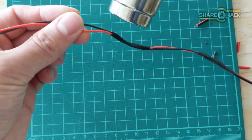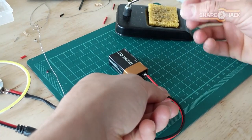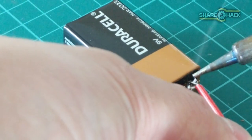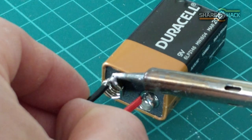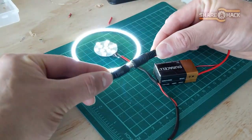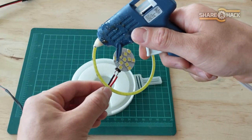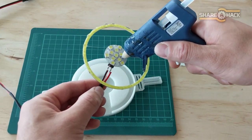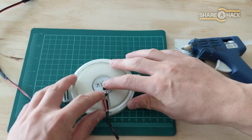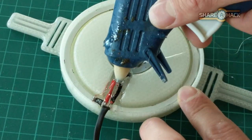To make the light a little bit more modular, I soldered the main wires to a male pigtail connector. I didn't have a proper 9 volt battery connector, so I soldered the female pigtail connector directly to the battery. If you do it this way, be careful not to heat up the top of the battery too much — the top part is made of plastic and too much heat will destroy the battery. Make sure your glue gun is nice and hot, then apply a minimal amount of hot glue all around the lights and press them firmly into the light holder. I used a little more glue to conceal any exposed wires and leads to minimize any chances of a shock or short circuit.